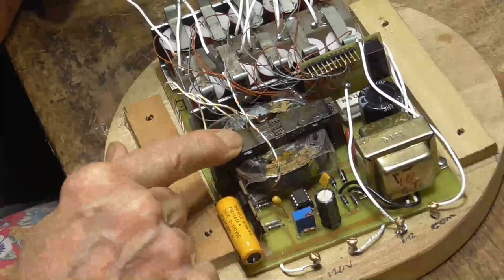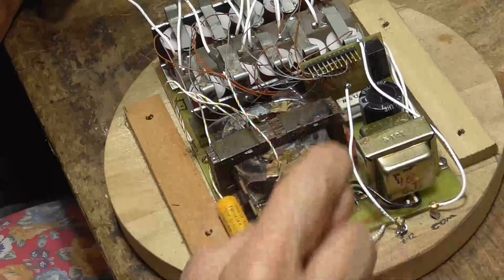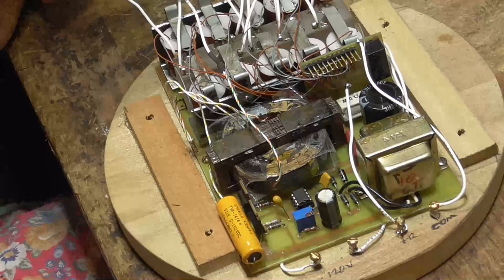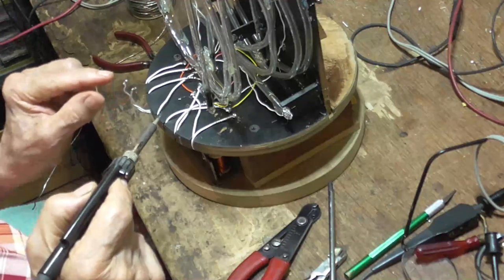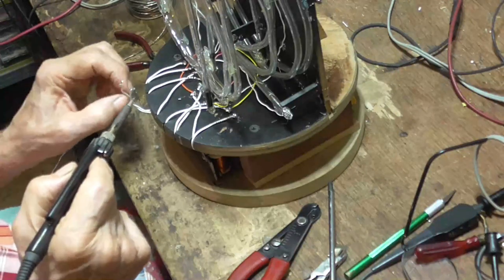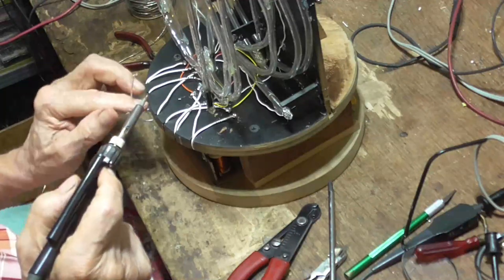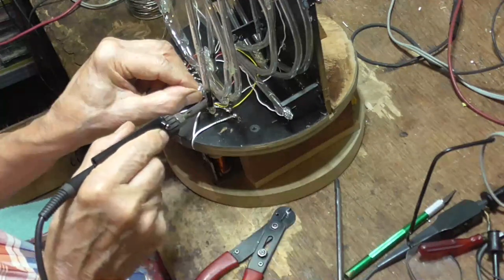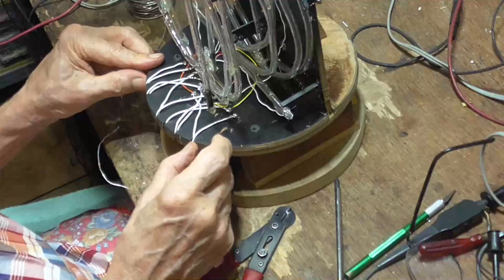That's the transformer there. The primary is the 100 volts at 400 hertz. The secondary is the 2500 volts. It puts out around 2500 volts at 400 hertz. Okay. 5 is hooked up already. Okay, we've got 6 and 7. Okay, that's 6, and the next one's 7. Okay, so 6, we can go here. Okay, that gets all of our wires hooked up.